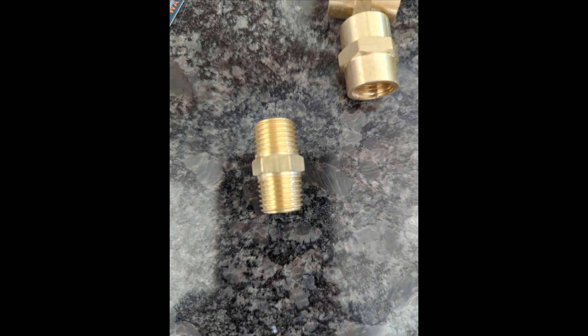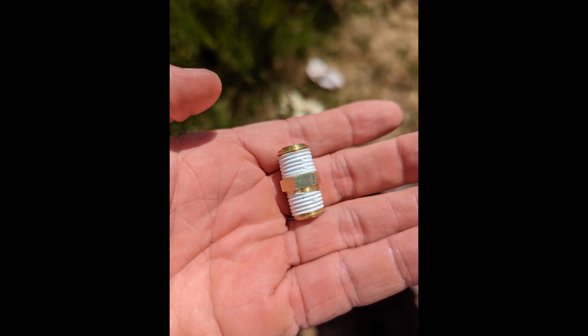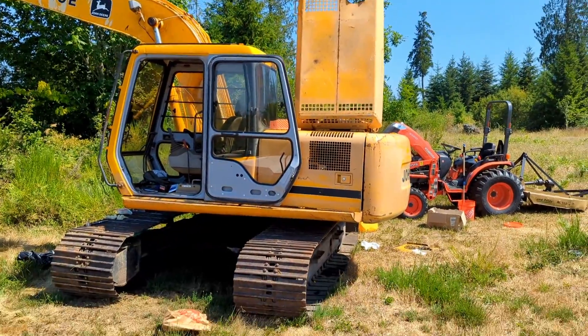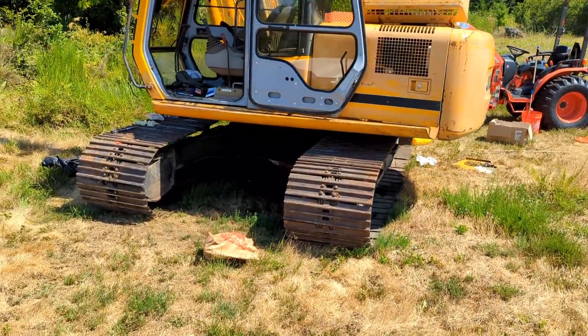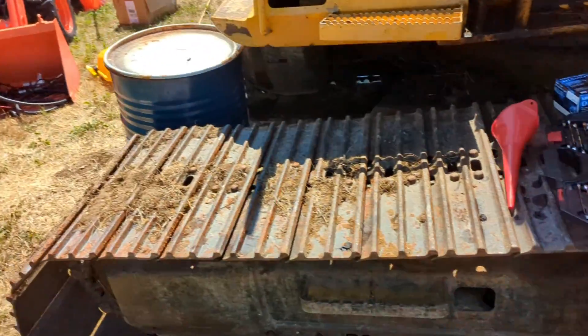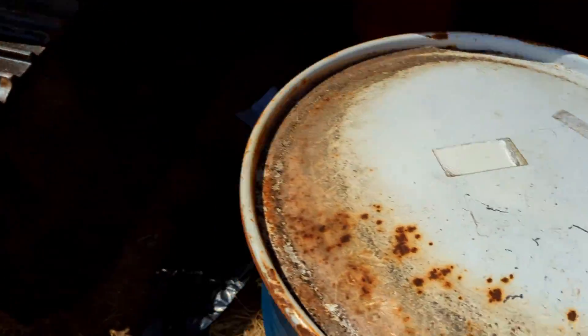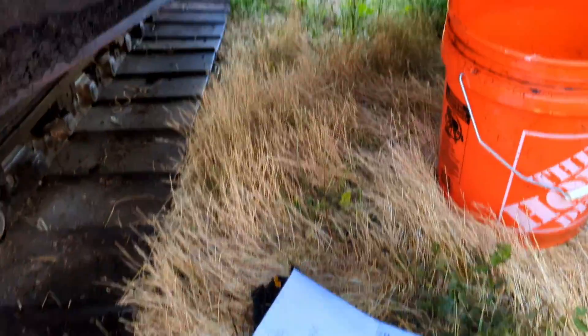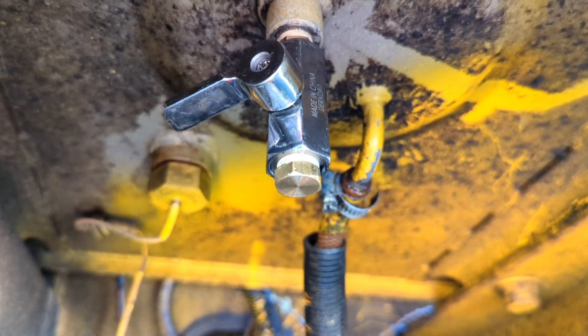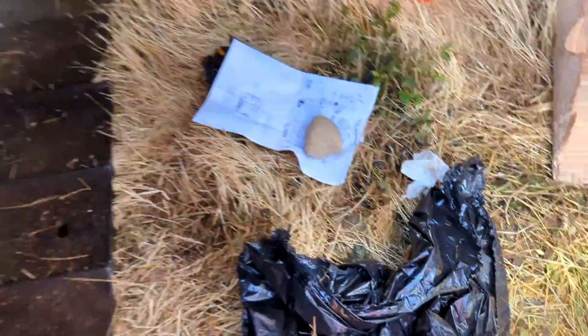Here's my fresh fitting — I got two on Amazon, and now I understand why. I'm using thread tape this time, which I should have done the first time and I wouldn't have had leaks probably. Now it's up in there with thread tape and it's not leaking. Oh thank god it's running. Hopefully my fuel drain is not leaking at all. I put a piece of paper under here to help me see if there's any leak. No leak — hell yeah!